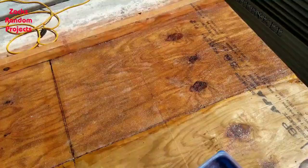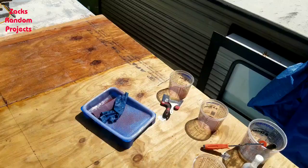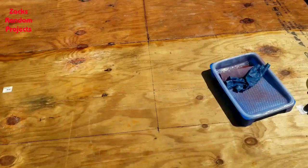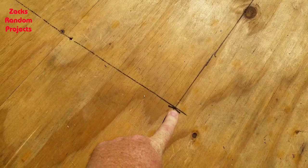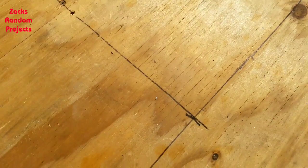But I'm going to come down off this roof, take a break, let this dry out by the sun, and then possibly here in a little bit come up and do the second layer, from the 25 inch mark to the 50 inch mark. That'll be slightly more than the first sheet done, because here's the sheet line, and here's where the 50 inch wide fiberglass will come to. So the fiberglass is not falling on the stud line where the sheets meet. It's fallen maybe about 8 inches later. So anyway, let me stop yakking and go inside.